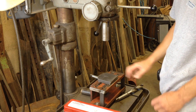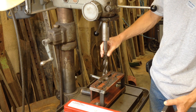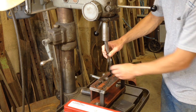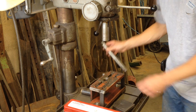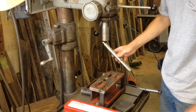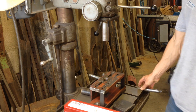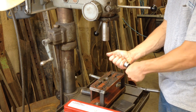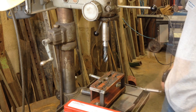We'll clamp down the piece of metal. With this piece of metal on here I can't get my nice bit to slide up in there — I can barely even get it when the metal's not on there. That's why when I set this boring bar in and get the table height set right, I run it all the way down with the quill stop. I still don't have enough room to use a good Morse taper drill bit, so I've been using a half-inch end mill holder — drilled it, put it in there — and that works great, gives me plenty of clearance.